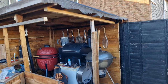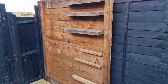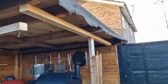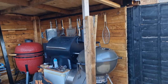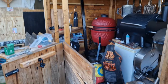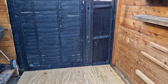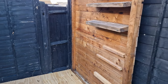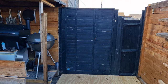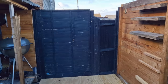I've taken the very end off and got that into position — just got to get that square. It's just screwed into a fence post to hold it up at the moment. To hold the existing roof up, I've put a batten in across the top and then just put a wedge in there to hold that in place — the front's flapping a little bit but the main weight is being taken by the wedge. It's going to give me a fair amount more space across the back. So we're going to get this end squared up and then start getting the framework into place, probably starting with the roof battening across.